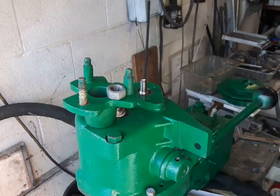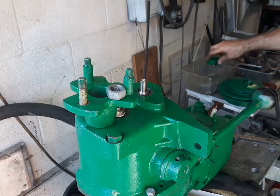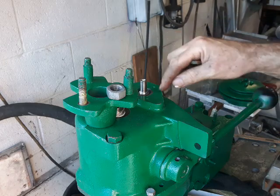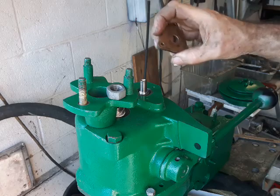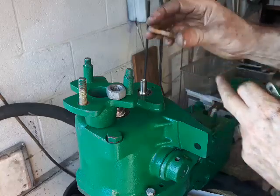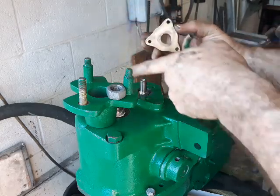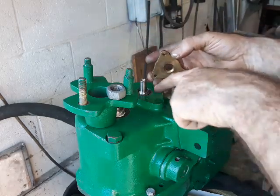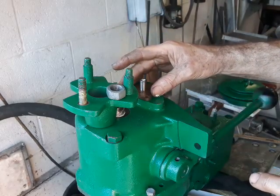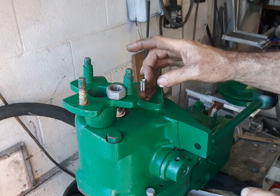Afterwards, fit your impeller housing and gasket. You have a gasket on here, then your back plate with the chamfered bit on the underside — usually the flatter side goes at the bottom. Hylomar on both sides. If this is rusty, cut a thicker piece of paper for the gasket; this is not a fussy side and it will seal nicely. Then put your woodruff key in, then your precision 15 thou gasket which I supply.